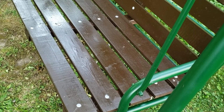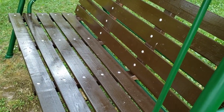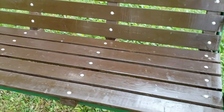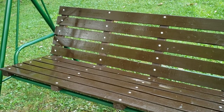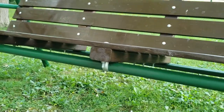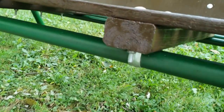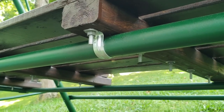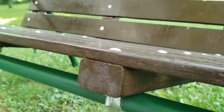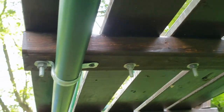The sitting portion of the swing is made out of 1x4s — this is just plain lumber, the cheapest kind you can buy at Home Depot. The braces you can see back there and on the bottom here are 2x3s. The swing itself is actually only attached in 4 different locations. The first of which is here. This bolt goes through the 1x4, the 2x3, and then on the other side I simply have a conduit little bracket, and this bolt goes through the wood and through the bracket. On the other side it's attached with a simple wood screw.